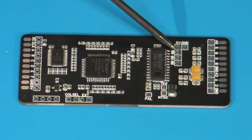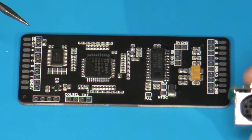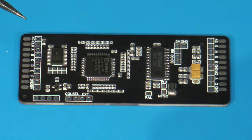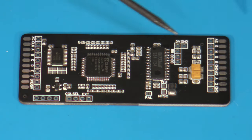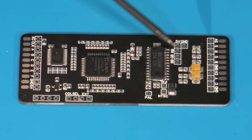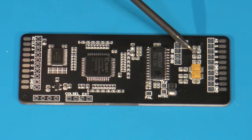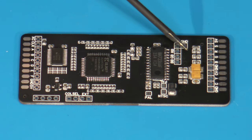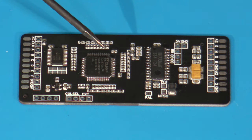And the purpose for these vias is if you were going to install this kit and use something like a 9-pin mini DIN, say like for Sega Genesis use, then because some of these components are already inside of most RGB cables for Sega systems, it can cause the video to look rather dull and dark when you use the normal outputs. So by taking your blue, green, and red from here before these resistors, you're able to provide yourself with a much better, much cleaner picture for Sega cable use. So he has redesigned the board more easily for use for both types of installations.